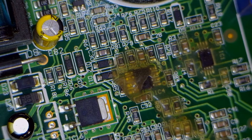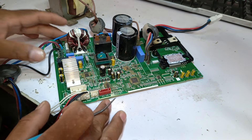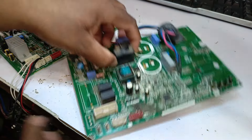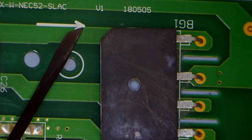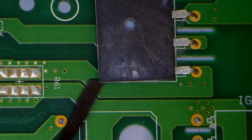I've also made another video where I explained what the circuit looks like after this operational amplifier IC. Now, let me explain the DC circuit using another circuit board where I have removed the components, making it easier to understand. Here, a bridge rectifier is installed. When the voltage is converted to DC, this side is the positive side and this side is the negative side.